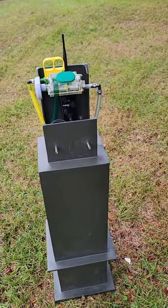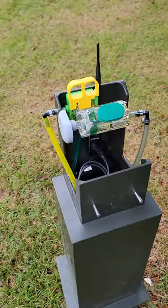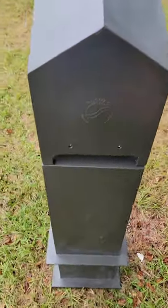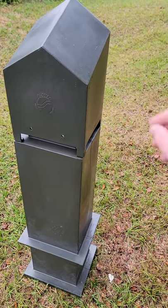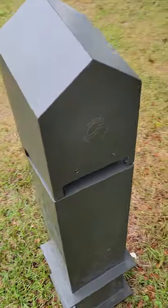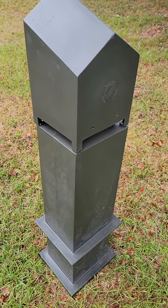The options are rather endless. I just wanted to show you what the dedicated air terminal looks like — getting a lot of questions as there are a lot of these going out to the market, and for good reason: it makes the operator's life a whole lot easier. First and foremost on a new install, it's where we put our 6-inch dedicated air inlet to the valve sump to maintain the correct air-liquid ratio. It's also going to have a 2-inch conduit that runs to the valve upper — on new installs, if you're using anything smaller than a 2-inch conduit, just be cautious, you're not future-proofing yourself. If you've got any questions, give me a call at 386-569-9125. That's Mike from FlowVac — thanks.